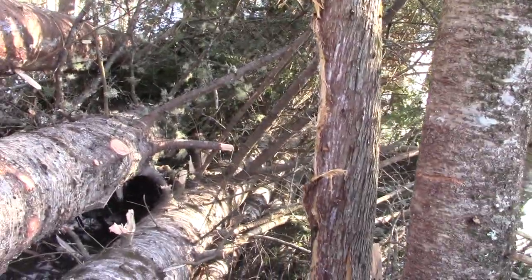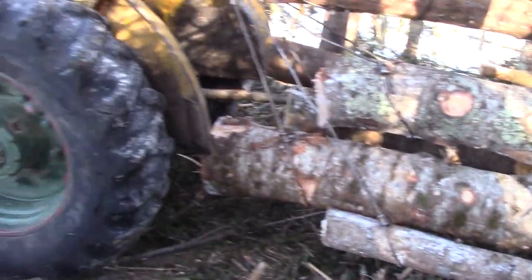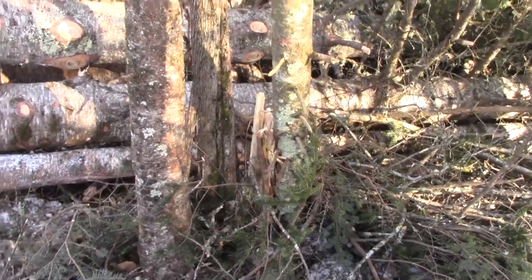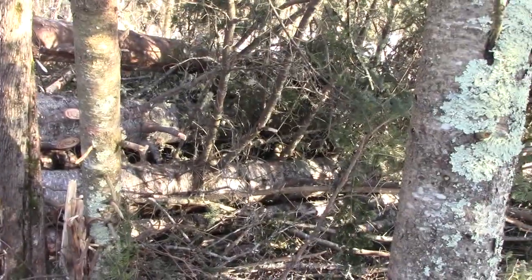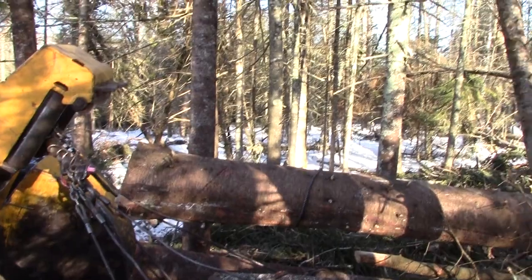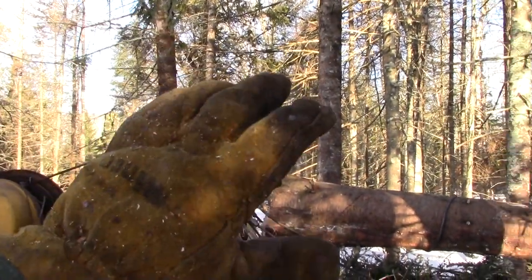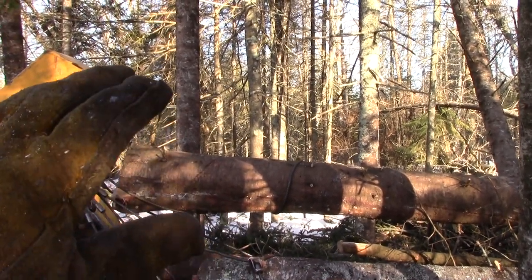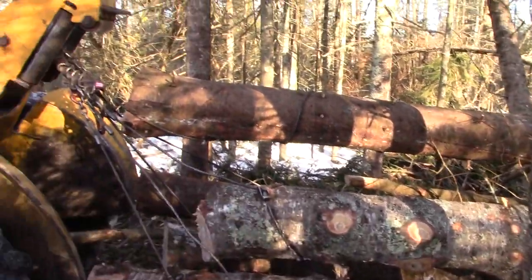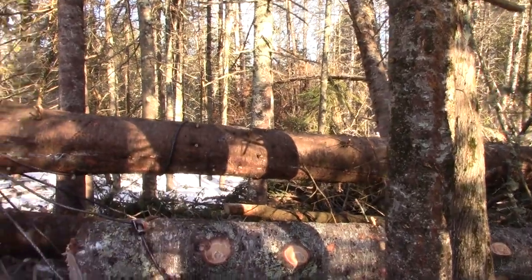It's a rat's nest. And what you do is we got a 90 degree corner right here with a corner post. When all that stuff comes by this first 90 degree turn, they're gonna wanna spin. They're gonna wanna kick out. It'll blow off a lot of those limbs. And on the other side of the hitch, this fir we're gonna cut later, because it's gonna get damaged doing this. You can't do this method in trees that you're gonna leave, because it ruins them. So anyways, I'll set the camera up, I'll come around this corner, and then I'm gonna back all the trees down through these young fir, and all those fir will bust off the limbs.